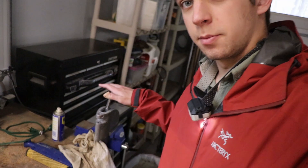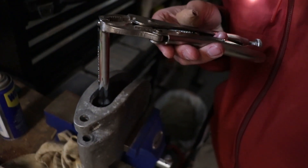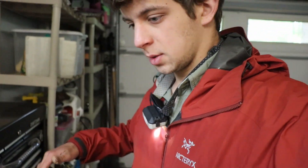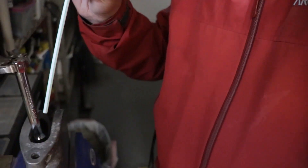So although I did end up calling it quits on the sanding, I ended up switching to the rudder casting. I had bored out the screw that sits on the spring in there with a drill and I grazed the threads, so I am recutting the threads with a tap and using an extender from just a regular socket wrench down into there. To make it all go a little smoother, I took a straw and just siphoned a little motor oil out, dropped it down in the hole here.